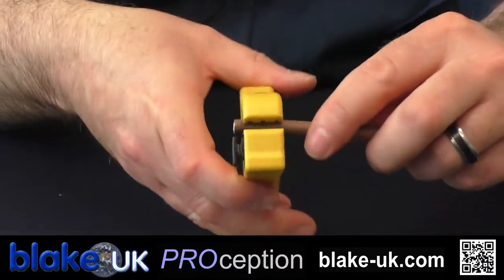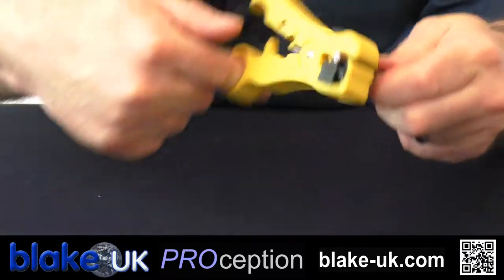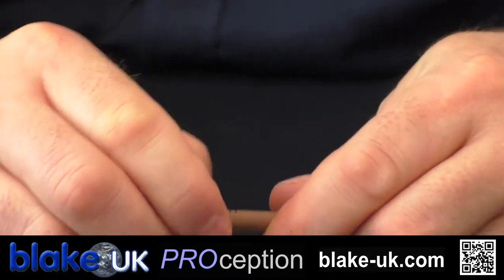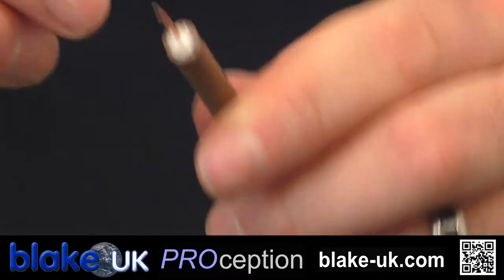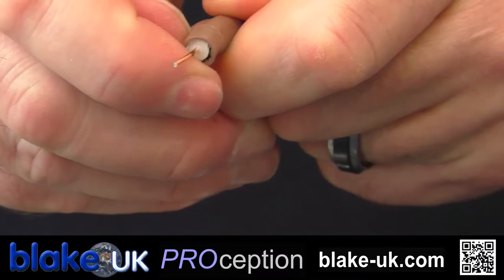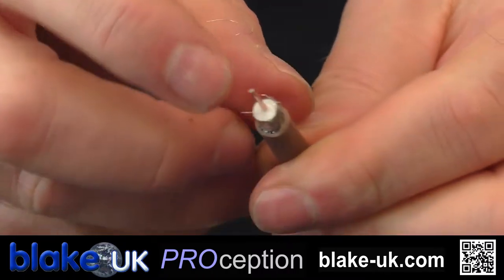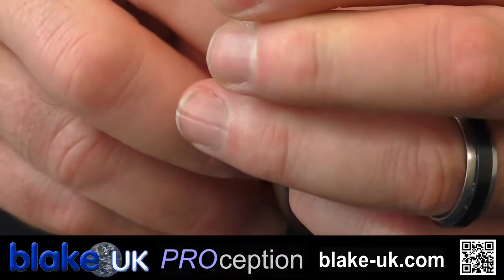Put the cable in like so, flush to the black plastic, and give it a twist. That does two things: it strips the first part to expose the inner core, and it also makes a shallower cut on the cable — on the PVC — to expose the shielding. So you end up with a cable like that.